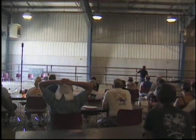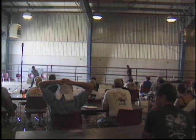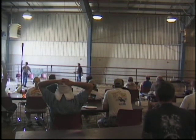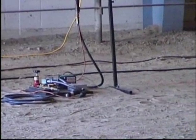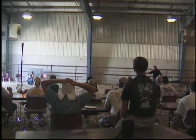Let's go to the fire bar. The fire bar is pretty simple. My controller is broken, but I'll show you what I've done. The reason for this plate and all this stuff here is basically I have my ignition, but I have a low fire and a high fire on that thing. So what I could do is light it, keep my flame low, then throw another switch, bypass the regulator, and go to high flame. Relatively simple — I'll show you how this works.